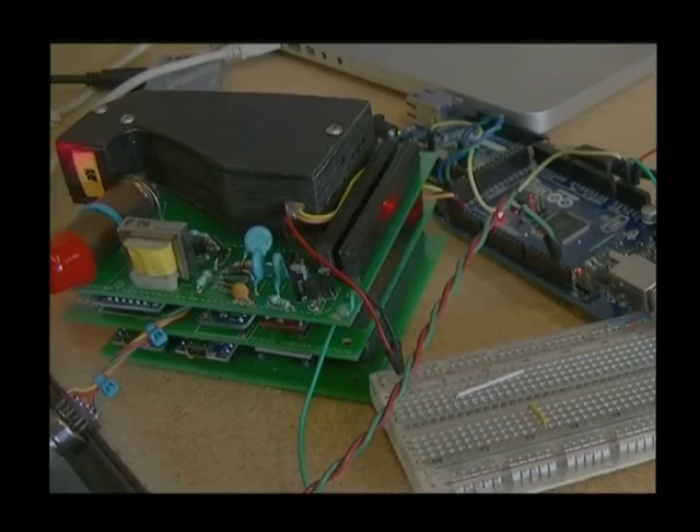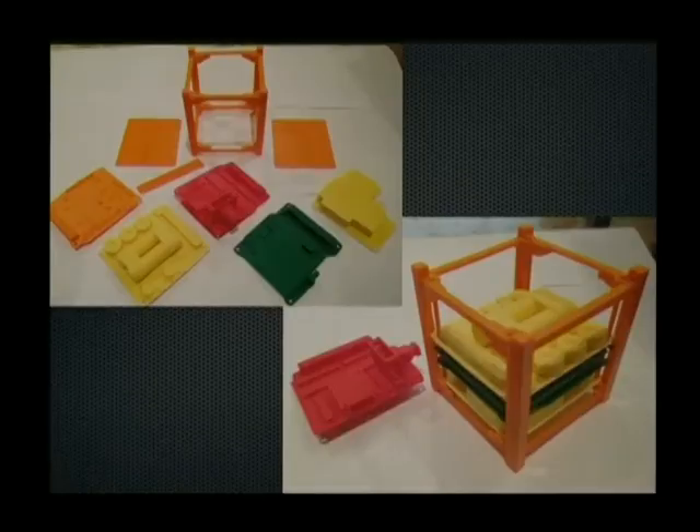Being a mechanical engineer, Jeroen is crazy about 3D models, so he modelled all of this. And of course, you're not allowed to have any project that doesn't involve 3D printing. 3D printing is awesome for checking mechanical clearances — just for making sure you've thought about things and haven't got it messed up in your head. They went to the trouble of printing some pieces, and this is a model of the satellite, with some parts already fixed, like the electrical power system in the bottom left with the two big 18650 lithium-ion cells.